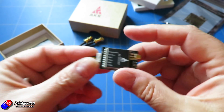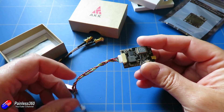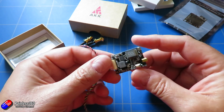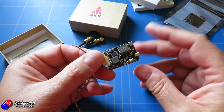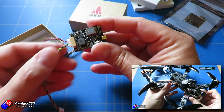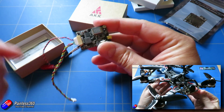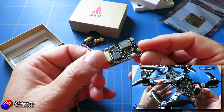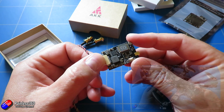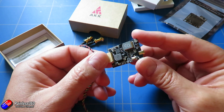That extra lead is for the smart audio. When I saw this, I was a little bit worried about smart audio — it's actually a TBS technology developed by Team Black Sheep, and it's the way that you can control the video transmitter from the onscreen display. I've had one of these plugged into the back of the Armitan Rooster that I got. It came initially with a basic 25–200 milliwatt transmitter, and I wanted the ability to change settings through the OSD, so I replaced it with one of these and it's working beautifully.